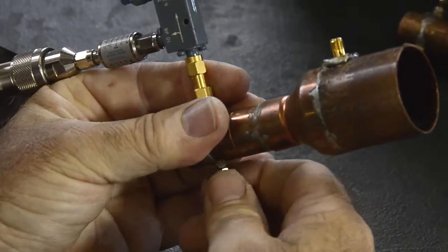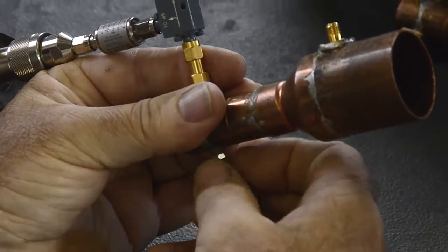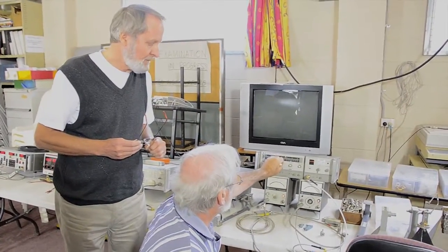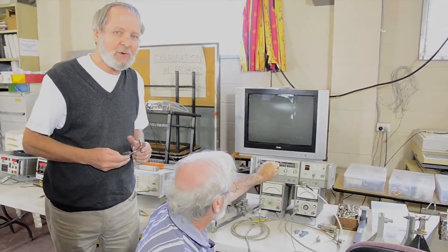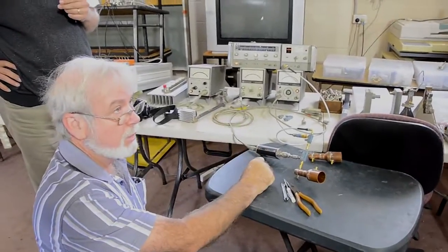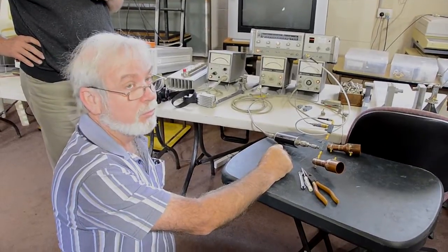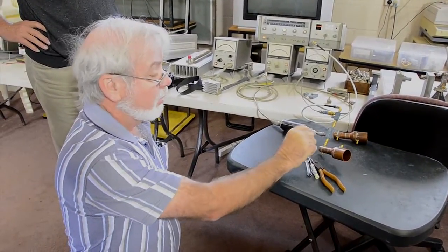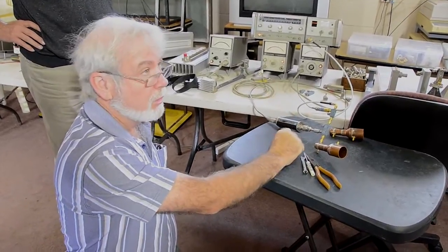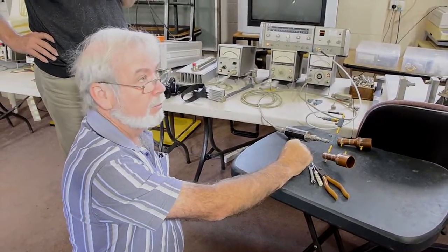What's just been discovered is that by moving away from 10.3 GHz where we want it to tune, by going down to 9.8 GHz, the return loss goes down to 16 dB — that's where the feed works best. This means the feed probe inside the dual-band feed horn is actually too long, so it needs to be shortened by about 500 MHz worth of shift. The length of the feed in there is only 7 mm long, so 500 MHz represents quite a percentage of change — probably about half a millimetre. The hard part is that it's right down inside and it's soldered on, so trying to get in there to actually do any adjustment is difficult. Got some work to do on that one, Doug.